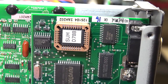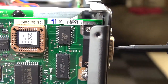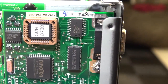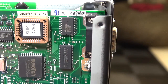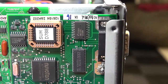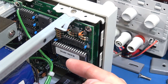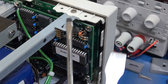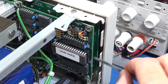That chip over there is the one EEPROM and on the side is where we have the other. So it's those ones I'm going to remove. This is attached to the serial input of the actual device. I'm unsure why both would need to be replaced — perhaps Paolo can ask the manufacturer — but nonetheless, let's see how we go. This EEPROM is the first one I'm going to try and remove. It's in a fairly tight spot. I've got a few tools at hand including spudgers and a screwdriver, so I'm going to gingerly get that out evenly from both sides so I don't bend any pins.